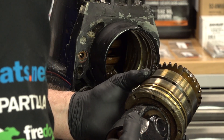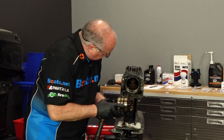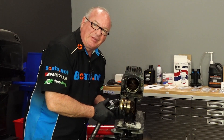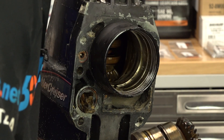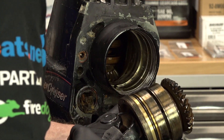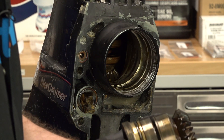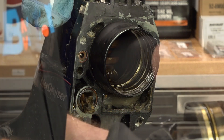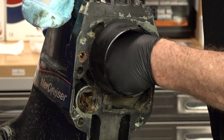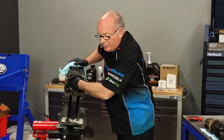Be careful when you're pulling this out — you've got your shim right there. She came out in one piece and does not smell healthy. The bearings feel okay, not too much wear on the gear. This one's got right at 800 hours on it total. Still, the bearings feel good, at least the ones I can get my hands on. So I'm still betting on the clutch at this point.